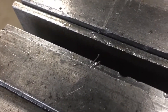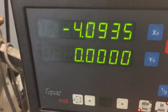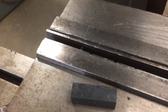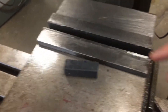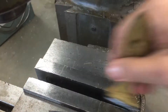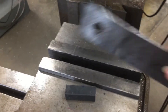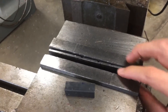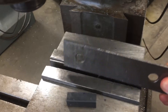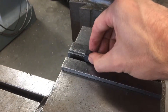There are tiny metal shavings that can create a real problem. When working on a machine that operates in the thousandths of inches, even a tiny burr can cause issues. So we want to take the time to clean everything out, including the bottom of the vise itself, before we put our parallels in. Once everything is clean, we put the parallels in place, making sure they're flush against the sides of the vise.